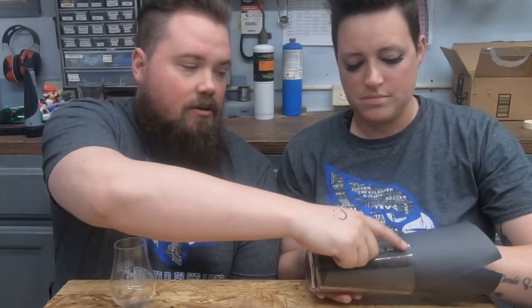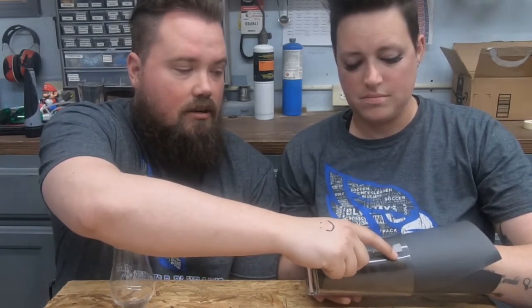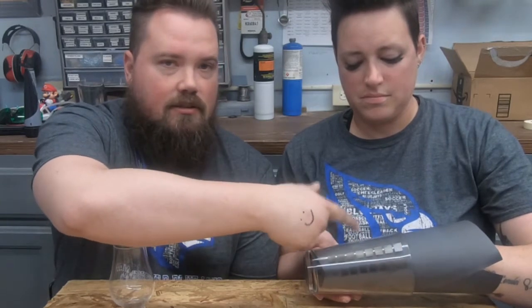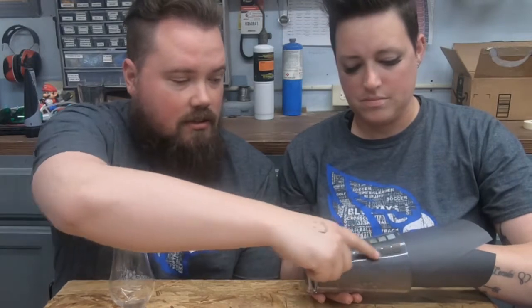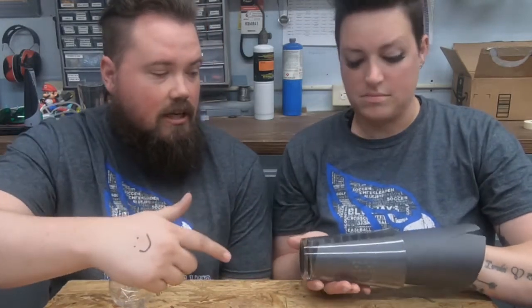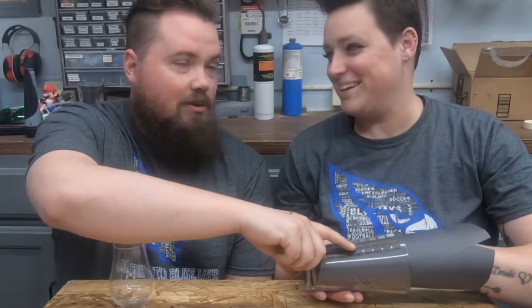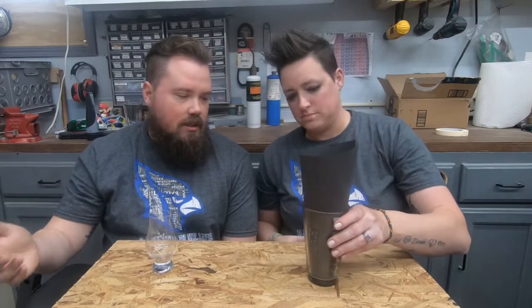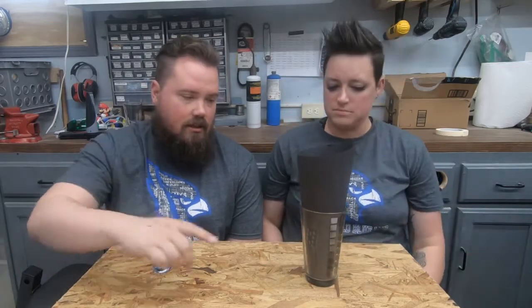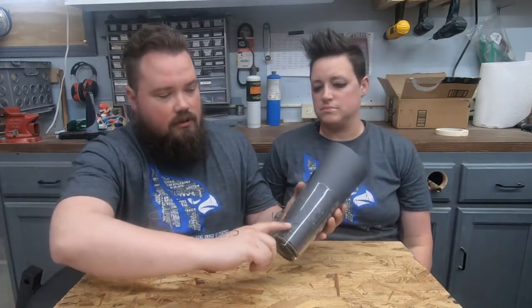And then 100%, which we really don't want to run the laser at 100% because you can burn it out, looks basically like 70% with the acrylic paint. And with air assist on, man, it turns out really cool black. So we'll probably try this on something later when we want it to be black. But what we ended up using that we liked the best for this particular cut is just the acrylic paint.